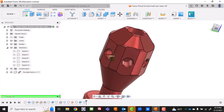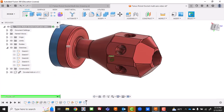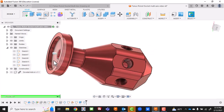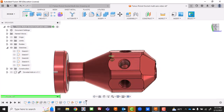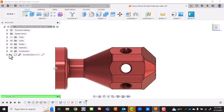I've got these three angled faces and these six faces around the outside with holes in them. I actually thought about tapping one of those holes. This part is for our FANUC robots - the backsides of them have a hole pattern that bolts on end-of-arm tooling on the end of our FANUCs. The idea is we'll run a rod through this counterbore - it's three-quarter diameter - so we can extend the length of the arm. That makes it easier to get into the mini mills and VF3s to change parts using the FANUCs. We love the universal robots, but the FANUCs are really good for long-run production stuff.